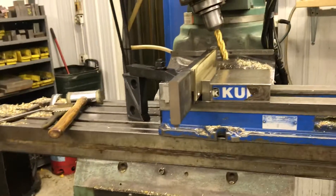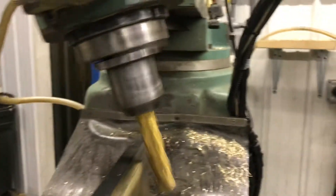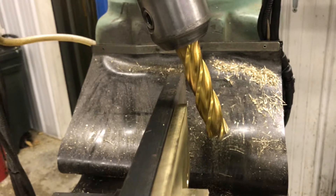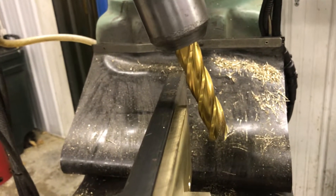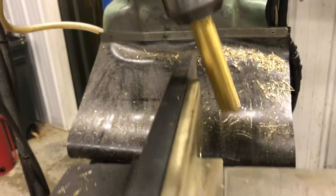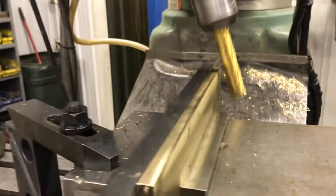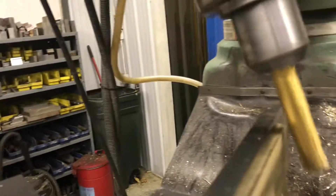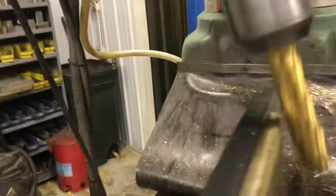Lay it out, because you need to make sure you're in the right spot where the holes go in. If your holes on the plate don't match up with these holes, your fit won't be very good. You've got to make sure you get the end mill going the right rotation. You can see the flutes there — if you go the wrong way, you won't be cutting anything. So you've got to go the correct rotation in order for this to cut. Now we're going to start out here — I'm going to come in and touch this thing off. It's just a small corner right now, and you'll be able to hear it start to cut.